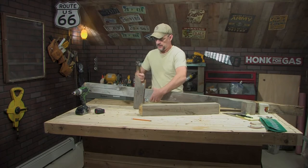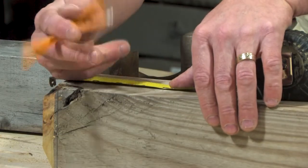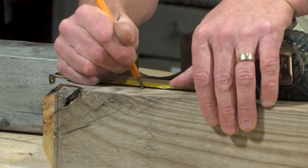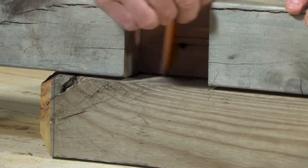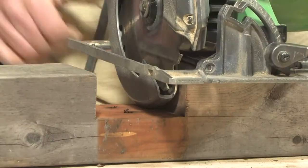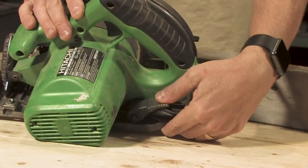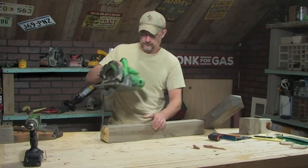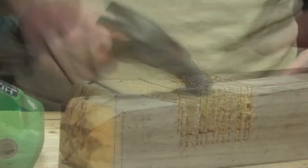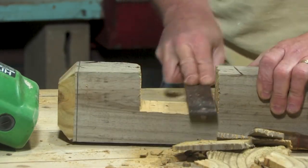Step 4: First I removed the old broken mailbox beam from the post — it's a small but important detail. You'll need to make several cuts to depth into the mailbox support beam in order to connect the post. Make a line 4 inches from the end. Then lay your post on top of the mailbox beam making sure all edges are lined up. Trace the cut out portion of the post notch to the beam. To set the proper depth of the blade, adjust the blade so that the teeth set on top of the post notch and the saw base plate is flush with the side. Then tighten the depth adjustment knob. Place the beam so that the traced outline of the post notch looks like the letter U. Make a cut on the left and right side of the U. Keep cutting the beam at eighth inch intervals until you have nothing left but thinly sliced wood pieces. Once complete, knock the slices out with a hammer. Clean out the leftover larger chunks of wood with a chisel. Then use a file to smooth completely for a better fit.